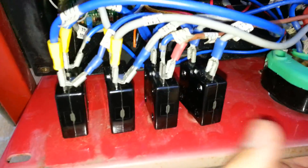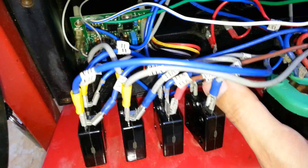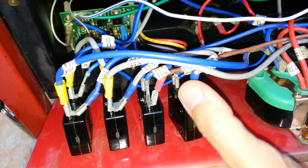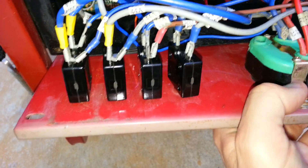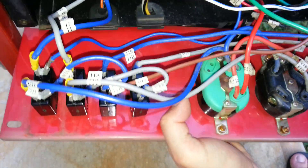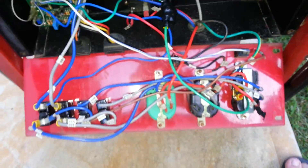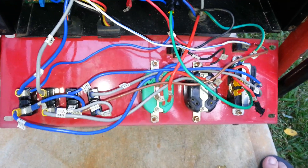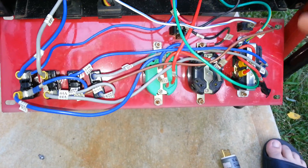The spade connectors just needed to be re-bent — they were very loose. I tightened both this one and the one on the load side as well. I'm 99% sure that will solve the problem. Now for my purposes with a transfer switch, the internal wiring needs to be changed. This is normally a bonded neutral, meaning the ground is bonded to the frame and the neutral is bonded to ground.